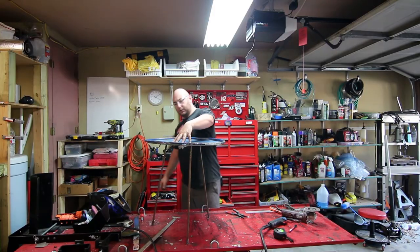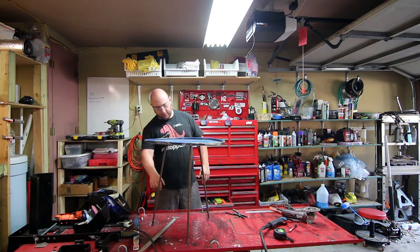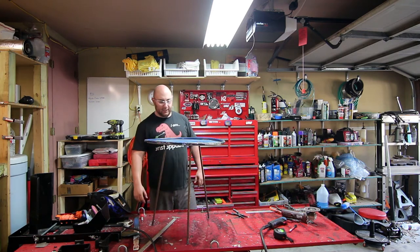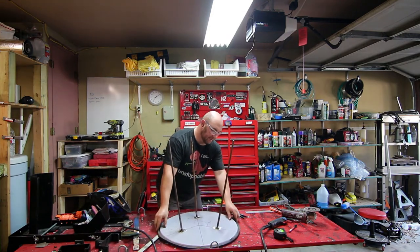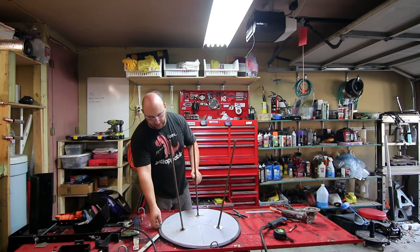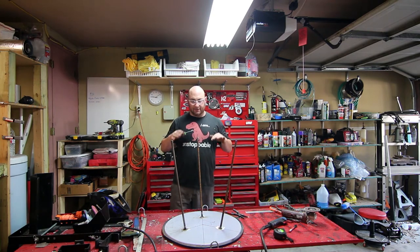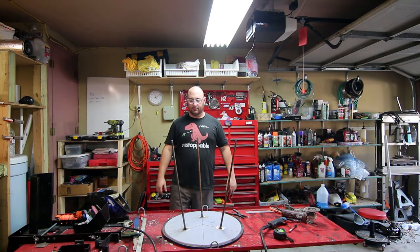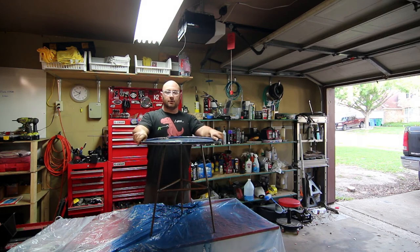It's reasonably well balanced and reasonably stable, but it's a little flimsy. So what we're going to do now is brace in these three rods with more pieces of rod and give this table a little bit of structure. Basically what I did after everything was welded up was go back and grind down the edges to give them a slight slant to balance the angle of the rods — tilt the table, feel the wobble, grind a little more, until everything was nice and solid. Now we'll measure these distances, figure out how far up we want to be, and cut and weld in some cross pieces.